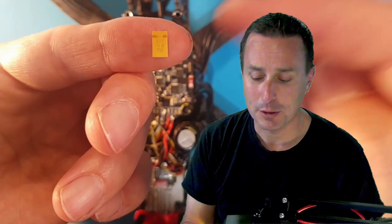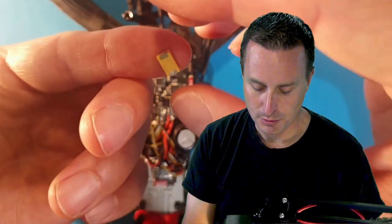When you are wiring these up, do note that it's a little backwards, that the dark line at the top, that's where you wire in the positive. I know on electrolytic it's backwards. If you see the little gray bar on the electrolytics, that's where you wire the negative. On these, the positive goes to this end. You can see there's connectors here in the back. So you just solder up to those on both sides there.